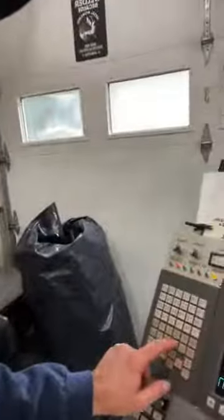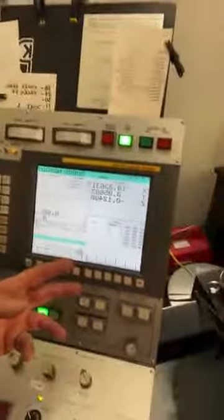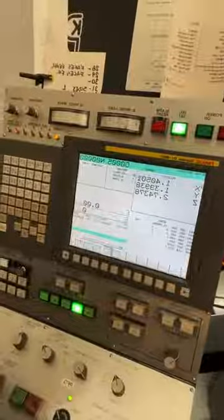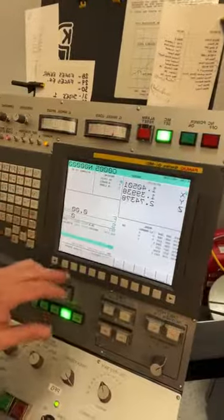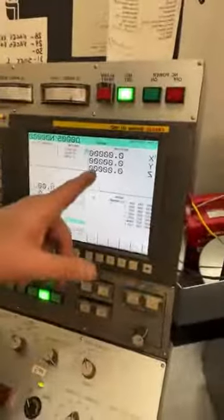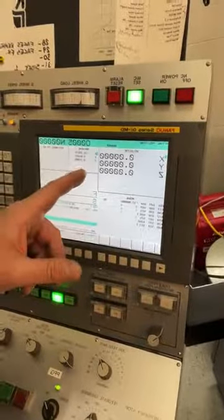One thing you should know is I'm coming over here. I'm going to be operating this in its standard Fanuc control mode. So I'm actually using the readout. That's all I'm doing here. So I can go X, origin, Y, origin, Z, origin, and I could set my numbers. So this is what I'm going to be using. This has 5 digits after the decimal point, and it's not fooling around, okay? So in the interest of safety, I'm going to leave this guy over here.